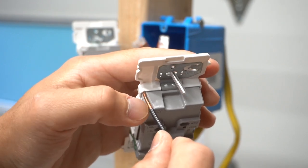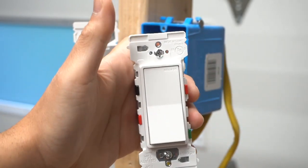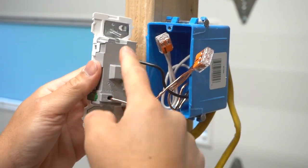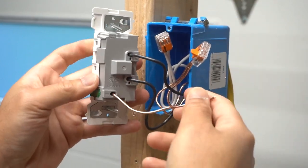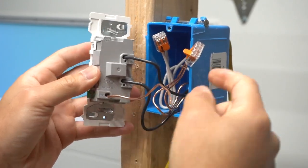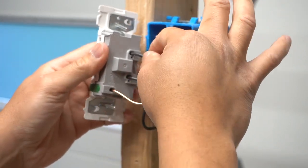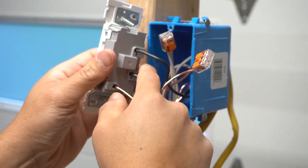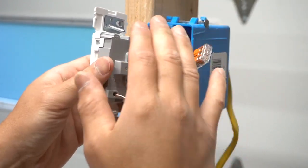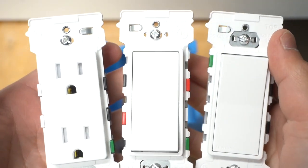The switch shows you how much you need to strip on your wires, which is a cool and practical design feature from Leviton. A great advantage of the Leviton Decora Edge is that if you have really short wires, you can easily reach each one of these ports without having to pigtail. However, I highly suggest you do pigtail just so you can have that extra room and extra freedom for the switch to move around in the box.